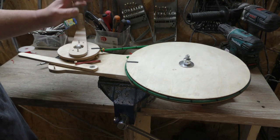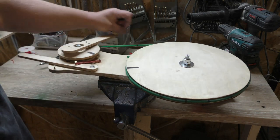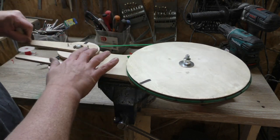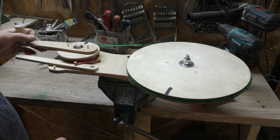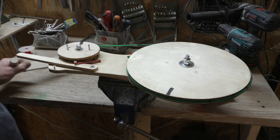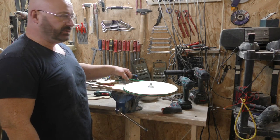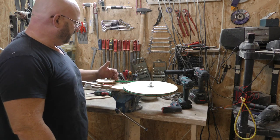Now the way you cock this is that you start winding. You can see the rubber is now spooled onto the small wheel here. And the big wheel is turning a little bit, just only a little bit, to feed more rubber. And then at some point I can stop, remove my little winch handle here, and release the entire action. Now why do we need the big wheel? Simply because the rubber must be kept under tension the whole time — otherwise if there is slack, there would be nothing that the wheel can pull against.